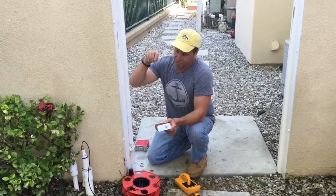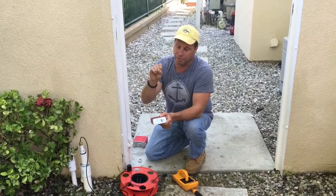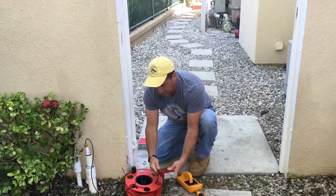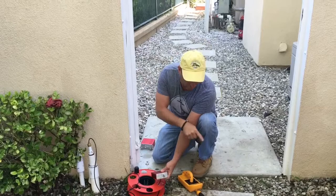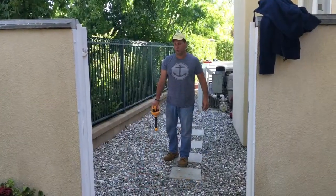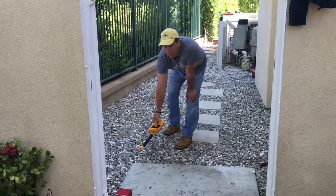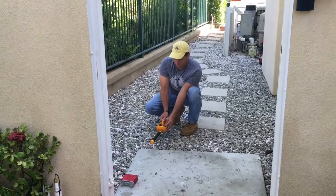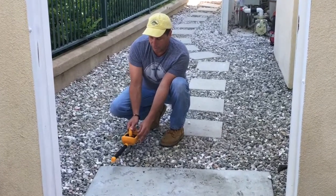We like to use it in pulse mode, because it eliminates any other interference that you're going to get with a sound. The flash head right now is over the leak. We are going to send that frequency out of the flash head by installing this. Then we're going to take our scanner and wand the area that we're working with, and we're going to find that head. So now we're scanning the area and listening for that very distinct pulse. Once we find that pulse, we can back down our sensitivity and pinpoint.